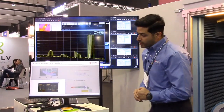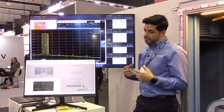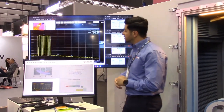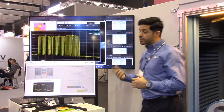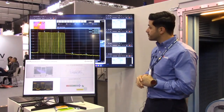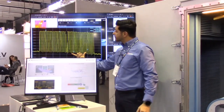For the next demonstration, we have different beam bandwidths. In 3GPP requirements for FR2, they usually require anywhere from 50 megahertz, 100 megahertz, 200, all the way up to 400 megahertz — and we can see 800 megahertz is coming also for FR2. First we turn on each beam at 50 megahertz, then we double the bandwidth to 100 megahertz — 100 megahertz for each beam. We want to show that these four beams, pointing at different reflectors at the same time, can have different bandwidths simultaneously. Eventually, we can merge two subarrays together and put 200 megahertz bandwidth, and merge the other two together, pointing to a different reflector with another 200 megahertz.